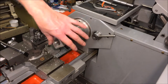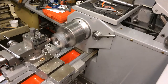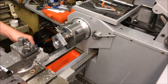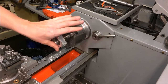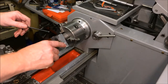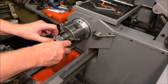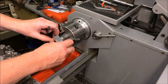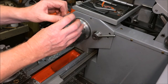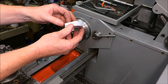Like the other face, that's cleaned it up, but to make it even I'll take another 0.2. Okay, looks good. I've got to deburr that face, and that other one just needs deburring as well. There you go, it's cleaned up nicely. I think that is the machining done on this body — it just needs the edges all breaking now to finish it off.